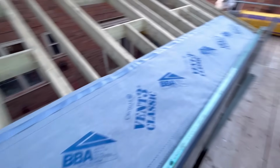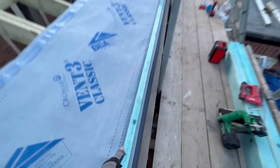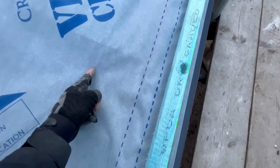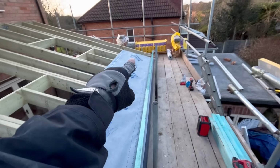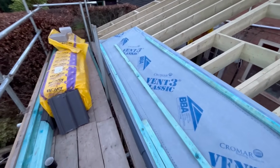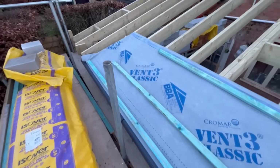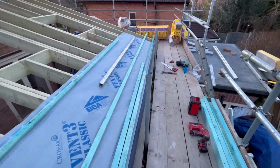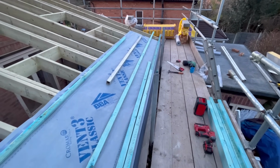So what I'll do now, as I've already mentioned, I know it's 200mm now, and I can feel the top of my eave protector, and I'll come up 200mm, pull a string line, and then a chalk line, and that's where my next lath will go. It's proving difficult and ineffective to use a chalk line, so I measured every so often 200mm off the top of this, and I'll put that into a string line as well, so that's level and flat and straight, whatever else you want to call it.